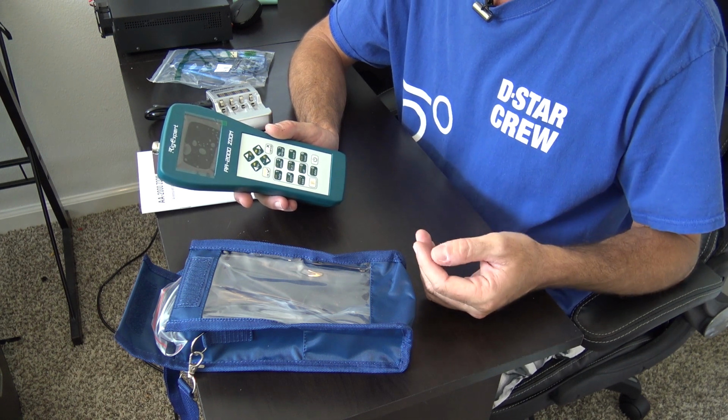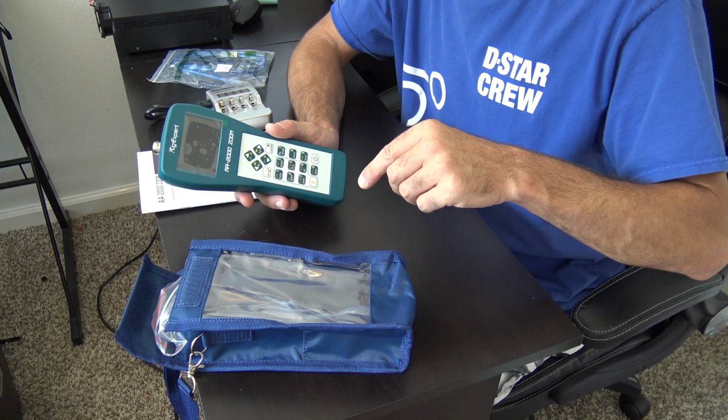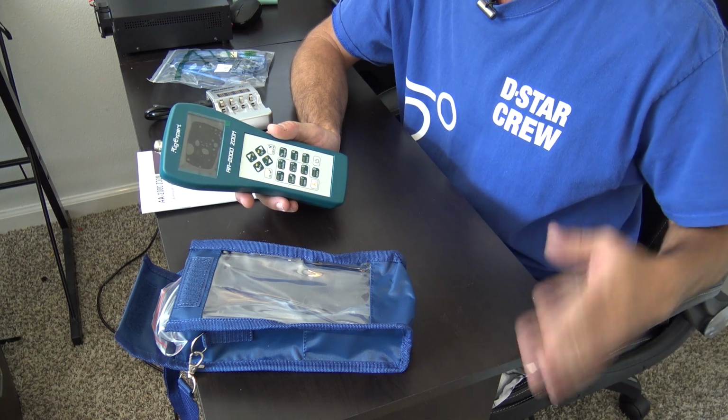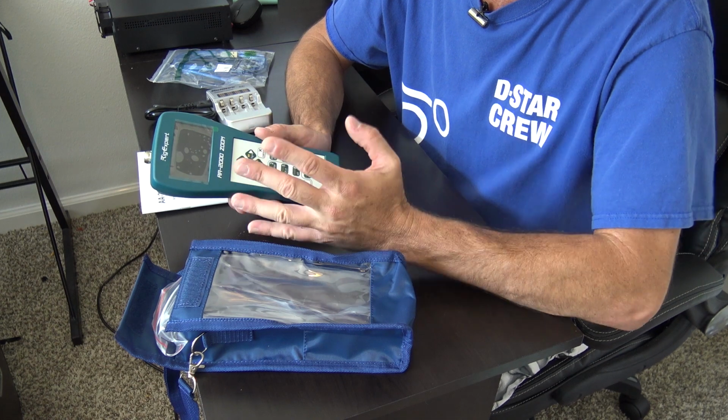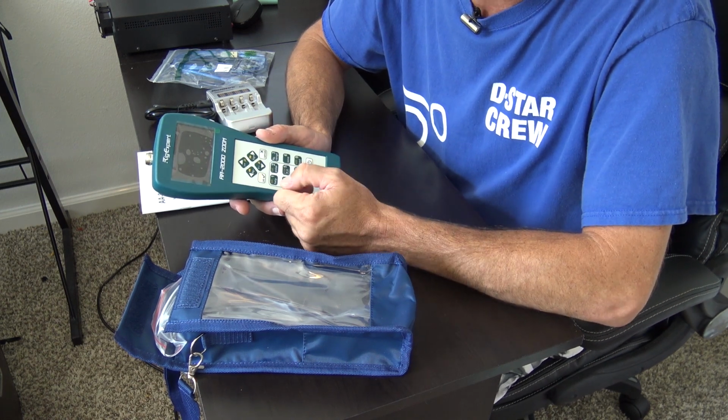Then I'll do a load, hit calibrate. And if I change it from UHF to VHF high band, forget it. I've got to do the whole thing over again. I can go from one frequency to another, or do 5 bands at one time on the multi-SWR on this